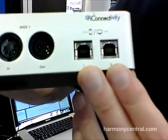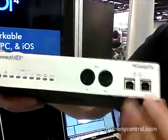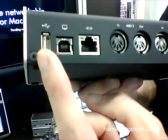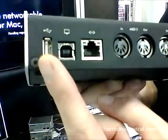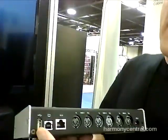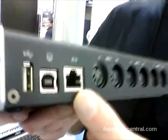We've got one USB device port in the back and two in the front, and this allows you to connect up to three PCs, Macs or iOS devices all at the same time. What's new compared to the 2 Plus is that we have a USB host port that allows us to connect up to eight USB MIDI class compliant keyboards and controllers. On this port here we also have an Ethernet port where we do RTP MIDI, which allows us to have up to four computers — Macs or PCs — also sending MIDI data. The audio passthrough is also supported on this box through the two device ports in front as well as the device port in the back and the host port.